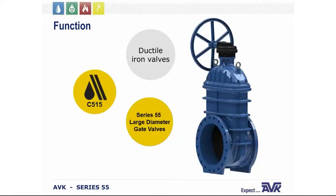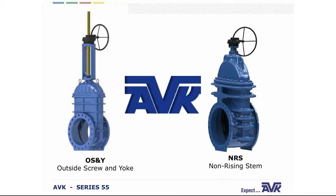These gate valves are cast with ductile iron and designed to meet the requirements of AWWA C515. And there's two types of gate valves: the OS&Y, meaning outside screw and yoke, which you can see on the left side of the screen there, and then NRS, meaning non-rising stem, on the right-hand side of the valve. And obviously, we're happy to provide both options.